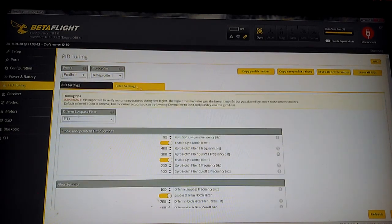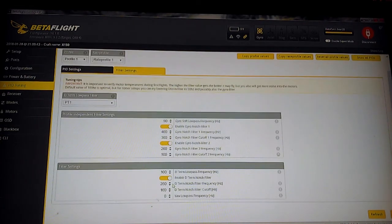Take a look at what I did with the filter settings. I'm running a PT1 low-pass D-term and I leave the default frequencies and notch filters alone. I have not disabled my notch filters — I'm not sure if that's a good idea on a four-inch with motors that have a tendency to get warm. So I think the PT1 is probably as far as I'm going to go with that.